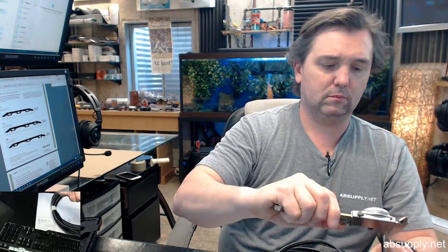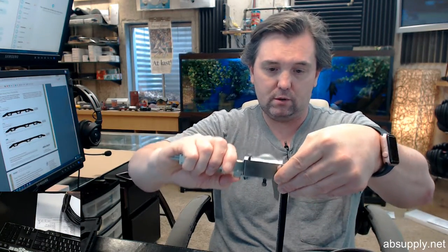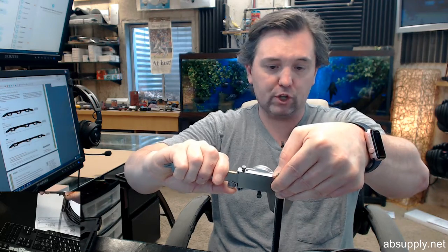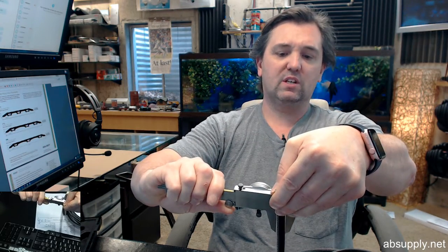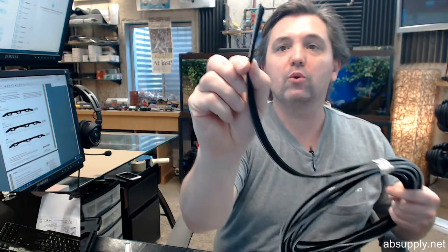Let me give you the strict dimensional properties now. The width is .112 wide — that's the width of the clear plastic backer. The total projection, and obviously this is going to be just somewhat approximate, is .444 — that's sewn together and closed up.